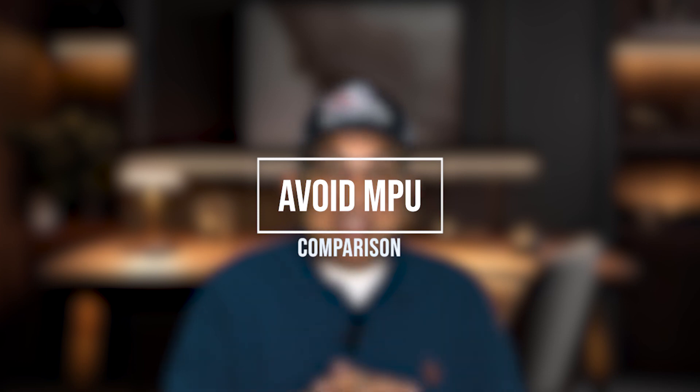Next, the ability to avoid an expensive main panel upgrade. When you buy solar plus a battery, you're generating a fair amount of current in your home. In some cases this requires upgrading your main panel — say from a 100-amp to a 200-amp panel, which is expensive. With Enphase 5P and the Franklin battery, you have a chance of avoiding that main panel upgrade due to how they're engineered. Neither SolarEdge nor Tesla have that advantage.